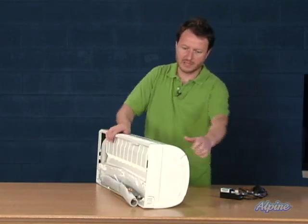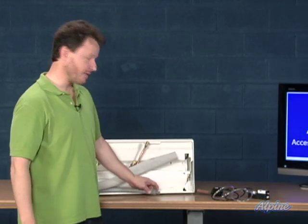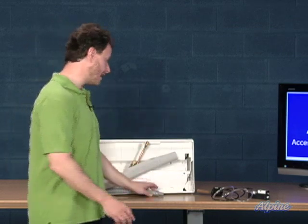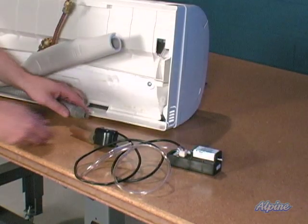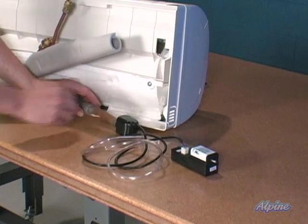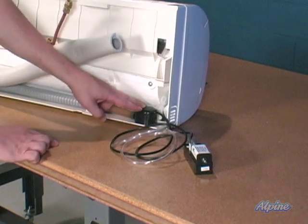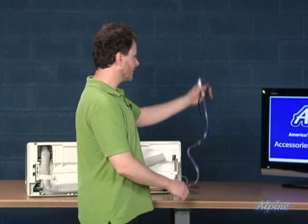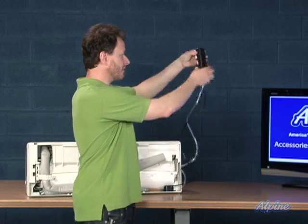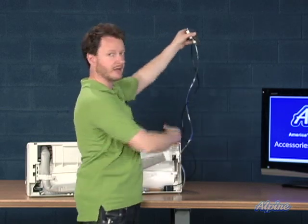This is the part that mounts on the indoor wall unit. This is where the water would normally come out of the back of the unit and drain out the wall to the outdoors. But if that's not an option, install the pump. We have the two pieces of the pump — simply take this hose and connect it to the drain line on the air handler, put the vent in the back, and then this pump will go up in the ceiling or overhead. Now we've got this tube and this wire — where will that go? That will be run usually in between the wall, though you can run it on the outside.